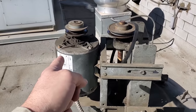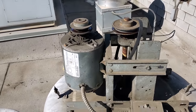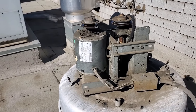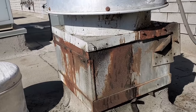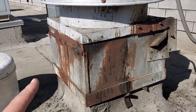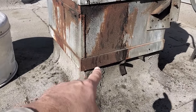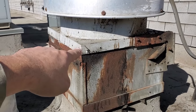We definitely have bad bearings or bearings going bad in the motor. But again, they said it wasn't running at all, but the fan's running. Now judging from the shape of the rust and everything, I need to get a look at that ductwork. I tried to hinge this fan and the whole curb came off — it's not bolted down right here. I tried to hinge it because there's a hinge kit right there and I can't get it to break free.